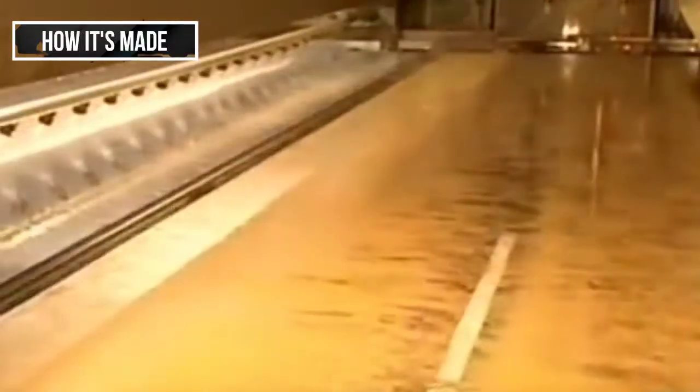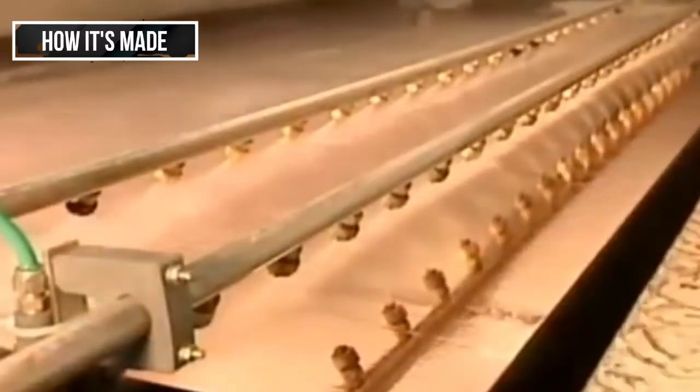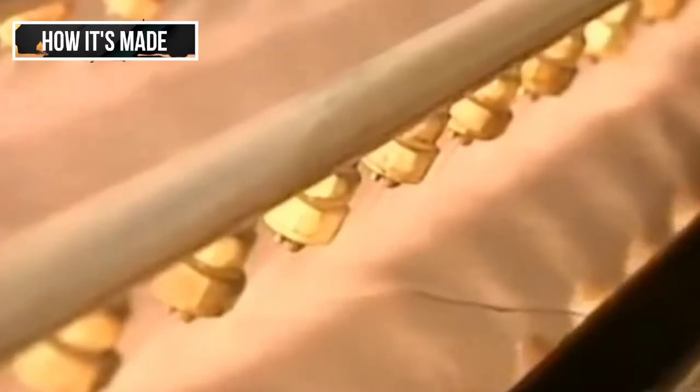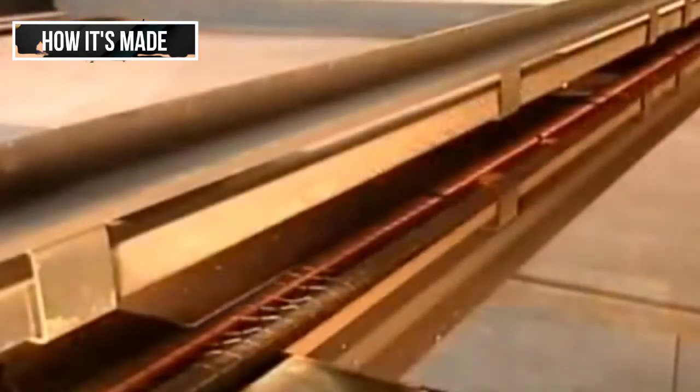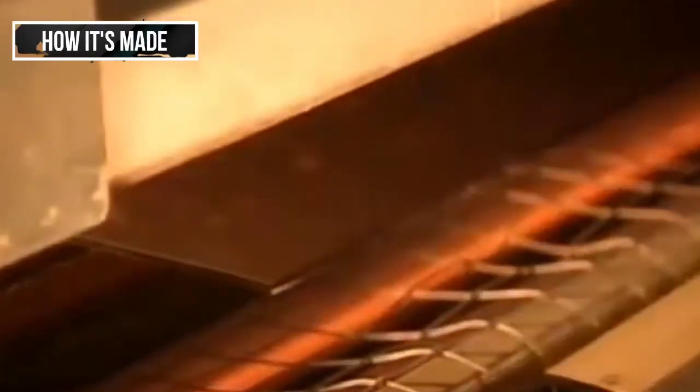The factory will seal this silver backing with 2 coats of paint. Paint by itself, however, isn't enough to protect the silver in the long term, so they first spray on a layer of copper. Sprayers rinse off the excess copper, then the panel passes through a dryer at 71 degrees Celsius. This evaporates the moisture on the surface in just 75 seconds.